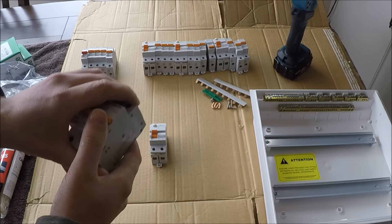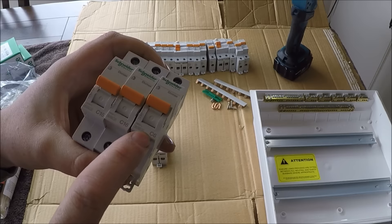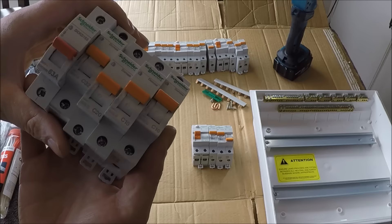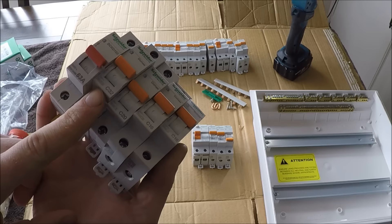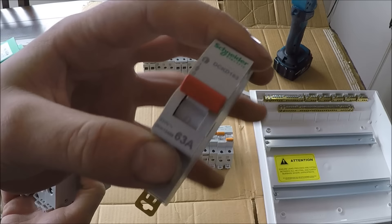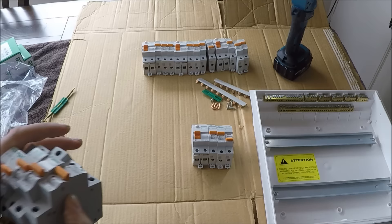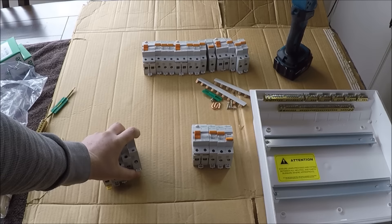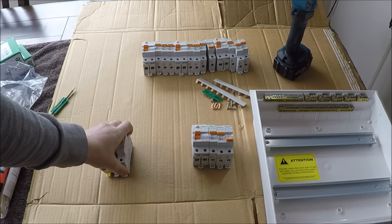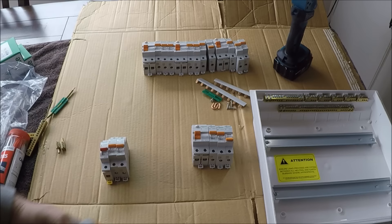When upgrading to RCDs it's sometimes hard in older houses to put your lighting circuits on the RCDs because neutrals are often crossed throughout the house. Other breakers I've got here: 32-amp for the oven — it's an induction cooktop, make sure it's wired in 6mm; if not, drop it to 25-amp. 63-amp for the main switch disconnector — that's not an MCB, it's a main switch disconnector. 20-amp for the sub-main which is the garage feed, and I'll be upgrading a surface-mount board in the garage.